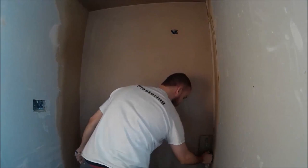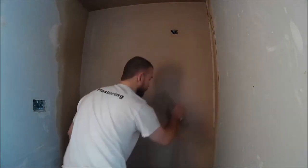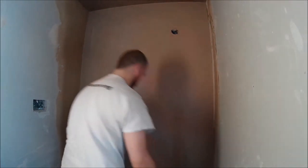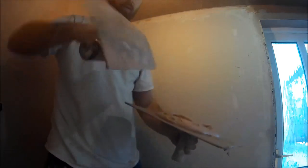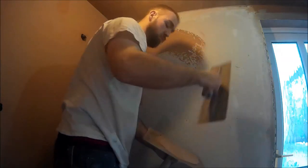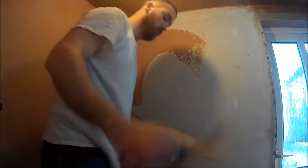As you're passing through, you're not really taking anything off — you're more trying to iron it out. The important thing is to leave the material on the wall and just get it flat, level, and smooth. You can see I've chased all the water into the corner. I've actually missed a tiny bit above the socket — that'll be okay, I'll get it on the next pass. That's the kind of thing you don't want to leave to set, especially after your third trowel.